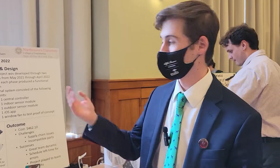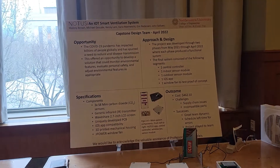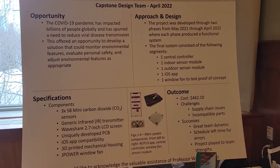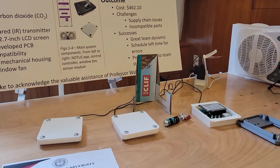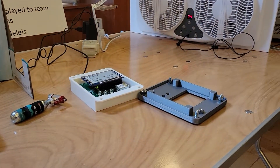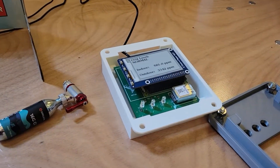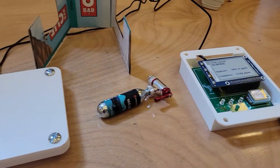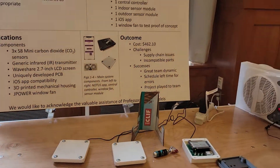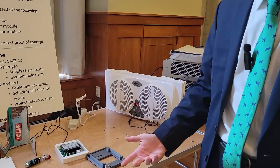This project is called Notice, focused on creating better ventilation to reduce COVID transmission. It comprises three sensor systems — two indoor and one outdoor — that compare carbon dioxide levels inside a room to determine if more people are entering. When more people are detected entering, it activates a fan to increase airflow from outside to inside, further reducing the amount of transmissible viruses within the room.